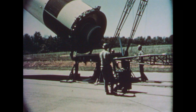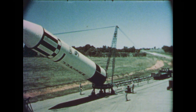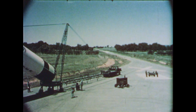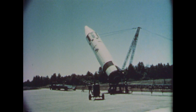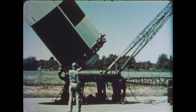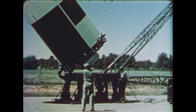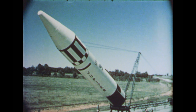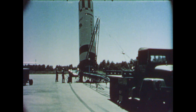At the approximate halfway mark, the A and H frame form an angle of about 45 degrees. The angle between the A frame and missile is always about 90 degrees. At the three-quarter point, the winch operator slows the spooling end of the wire rope as the center of gravity approaches a balance. Just before this balance point is reached, the snubber cylinder piston fork will engage a bracket on the missile's auxiliary ring. A mobile erection system such as this is a practical answer to the problems encountered in the tactical use of a missile the size and scope of a Jupiter.